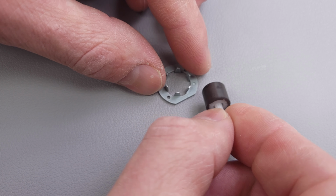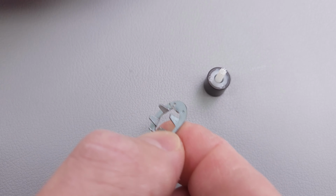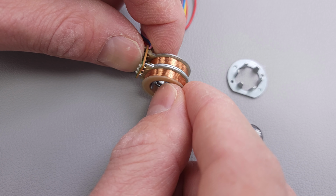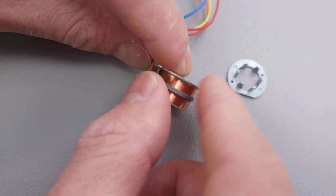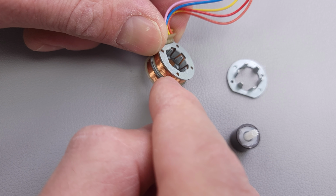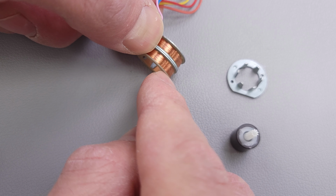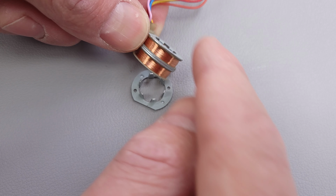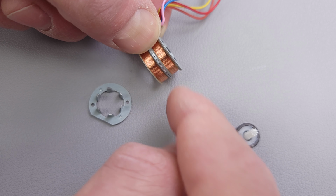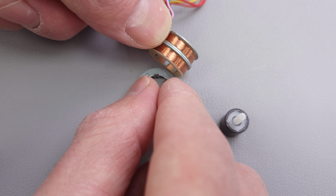And what happens here is the norths get attracted to the magnetic field that is north when it's applied onto this metal. So how a copper coil works is that every time that you supply 12 volt power to a coil, it turns into an electrical magnet, and then you have these teeth. So the teeth on the top may be north, and the teeth on the bottom of this coil right here is south. And then you power the next coil, and this set is north, and this set is south. You know, this set that was right in here. Then you power the next set, and instead of this being north, it's south up here, so it's reverse. And then this is north, and then you power the last coil, and this is south, and this is north. And the object is that no set of teeth is right in the same spot.